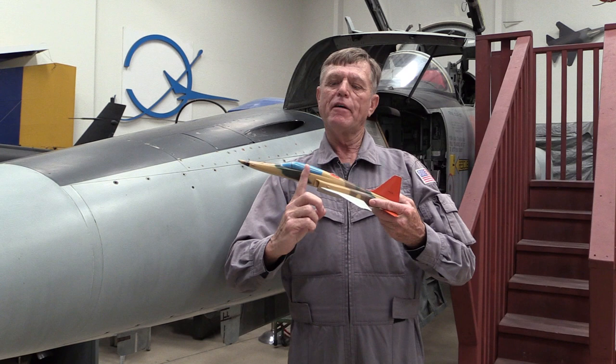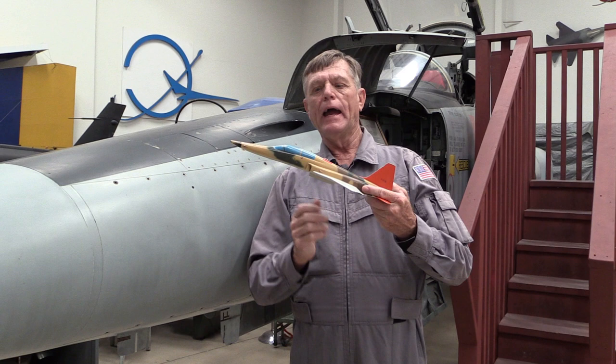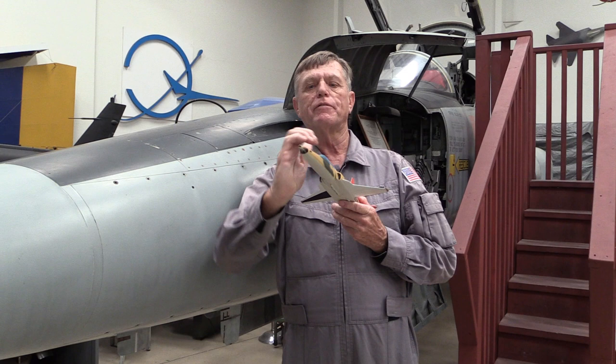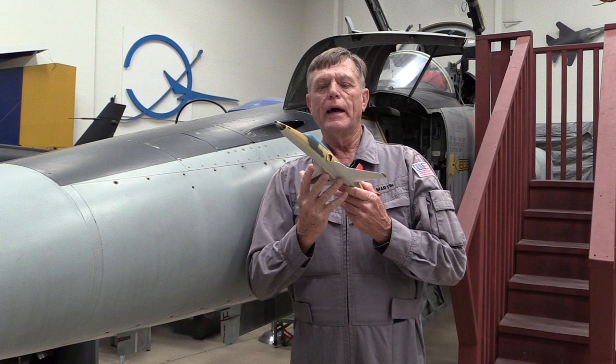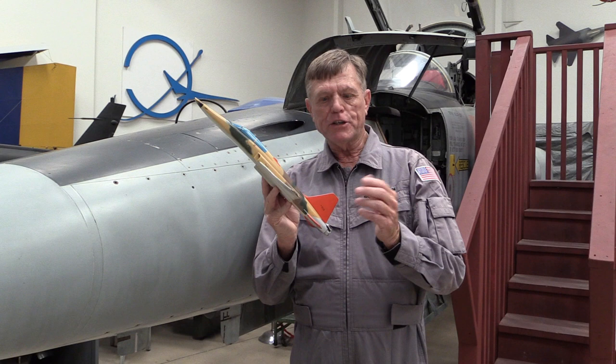When they made the F model, they took the E model, the single seat, chopped the fuselage, moved it forward 40 inches, dropped in a rear cockpit, and now all of these issues that were related to the nose of the airplane from this differential vortex flow has a longer moment arm by 40 inches. And what that meant was, in the case of the F-5F, especially at aft CG, when you had the vortex start, the nose would come up very abrupt, and it was much easier to get to a point where the tail was blanked and you were in a spin condition.